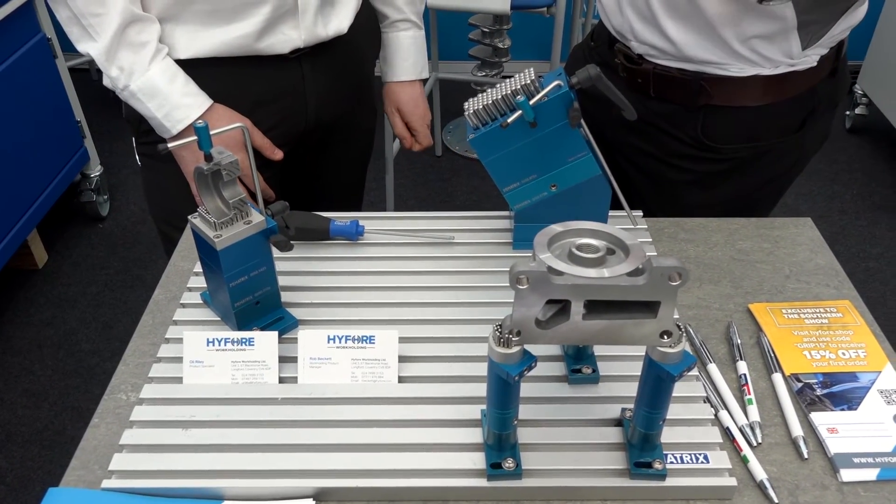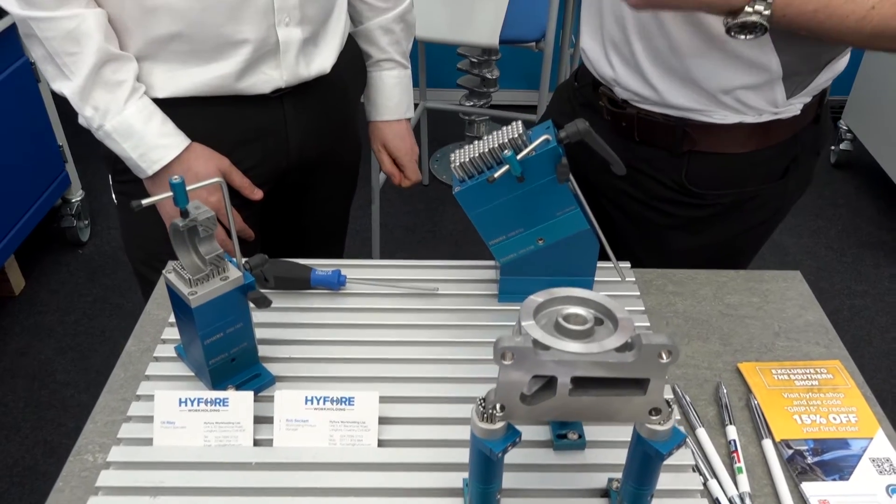And they don't fall off once they're on — like you've just demonstrated, once it's on it's pretty well fixed? That's correct. If it's in the flat position you don't need anything else, because we just had that one on the angle with the work support there to keep it in place. And you wouldn't use this on a machining centre then? Not the blue side, no. It's specifically for CMM. So if you're a CMM user and you do have problems putting parts on the CMM and keeping them in the right place, this is an answer to that.